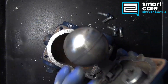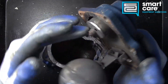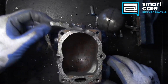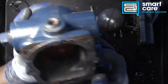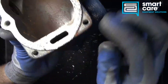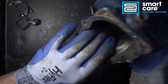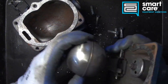Right away you can see that everything is pretty much on this side of the assembly. We've got our float — there's not too much else on the bottom. Looking at the casting: the inlet ports feed into this big cavity space, but the outlet port is not tapped into this space — it's drilled through into this little bottom passage. As condensate flows in it fills up the bottom of the cavity until it gets to the point where the float starts to do its job.